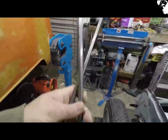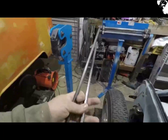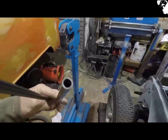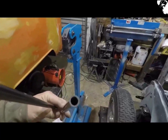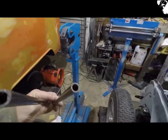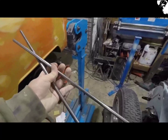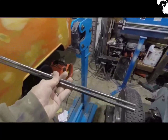I've just got this 10mm steel rod that's a metre in length — I've just cut it in half. The bore looks like it has about a 1.5mm wall, so I'll just bore that out a little bit so it slips over the collar where the wire comes out. Although it'll be a little bit difficult to bend, that should sort out my heater cable tube.